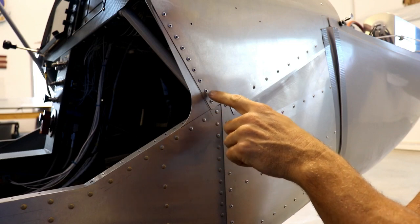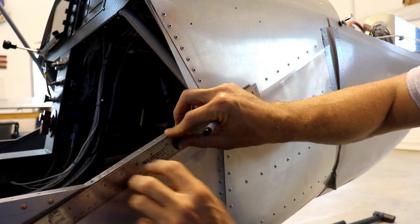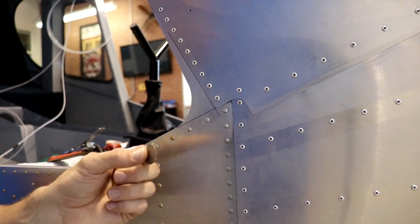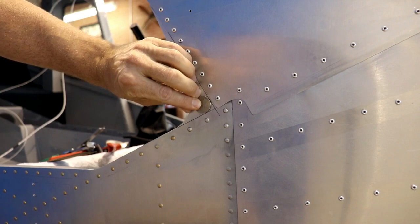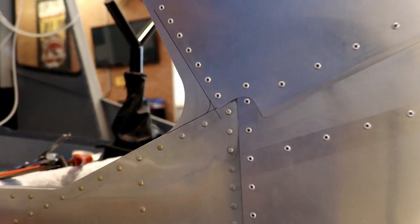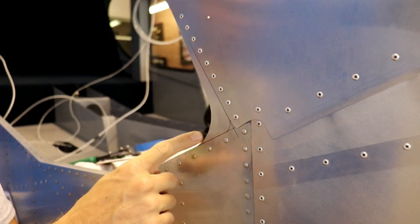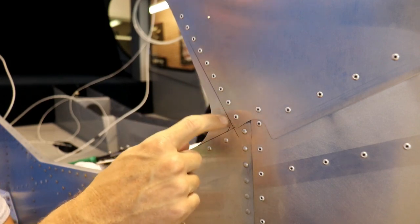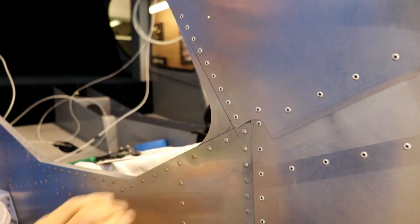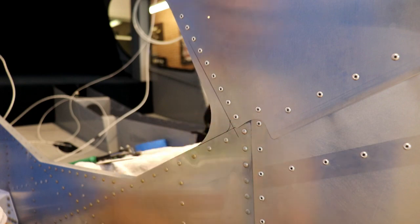I have two lines drawn on the fuselage. The manual says it wants 10 millimeters from the rivets. I drew the other line by putting a ruler flush with the frame and drawing a line on there. Now in order to make the radius in the corner, I'm going to trace a quarter — I'll put it touching the two lines and just draw a radius on there. You can cut this out a couple of different ways: you could drill a hole and use a unibit to get the curve, or I'm going to cut it out with the shears and use a Dremel attachment to do that curve. Everything will get cleaned up with a file.